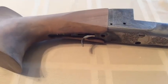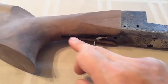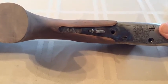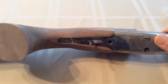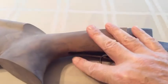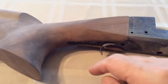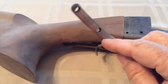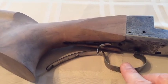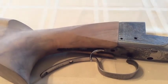Where we're at now is I'll need to make — because of the modifications I made in this grip — I'll need to make a trigger guard. My plan is to use a sand casting process to fabricate this trigger guard. I'm going to use this rear tang hole back here and alter the trigger guard so it'll just be here. Then I'll drill a hole through here for the rear tang screw to go through both the trigger guard and the rear trigger plate, and affix up into the top of the receiver.